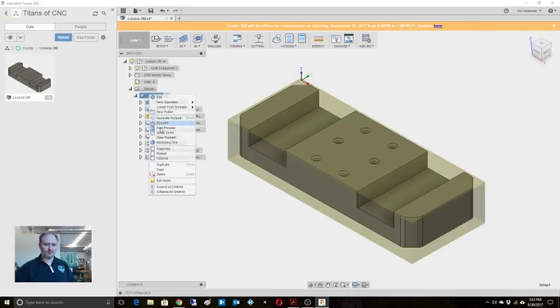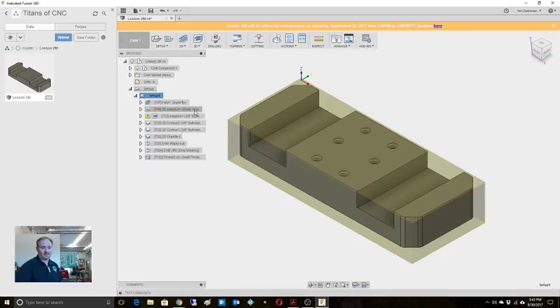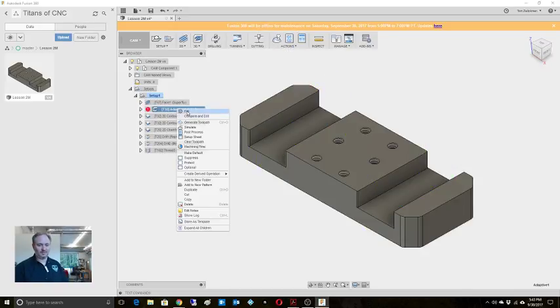And if I were to look at machining time, it didn't save much time, did it? 22 minutes, right? So that only saved me about a minute, and it added a tool change, which means I've got to babysit it, right? So frankly, I think the right way to go then is take the shear hog out of it, delete, regenerate this guy.